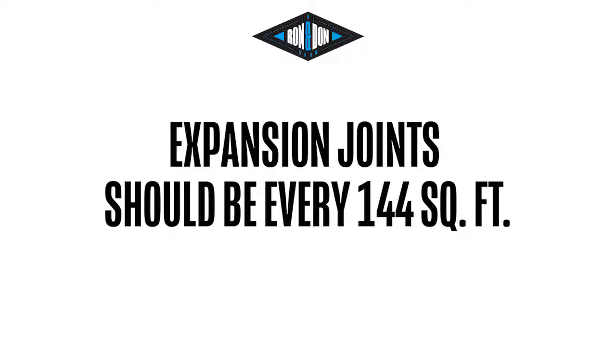If we're talking about a hard coat stucco system, and we're getting cracks, typically we have a couple of things going on. One, we could have a very thin base coat for the stucco, or two, we may not have enough expansion joints where they're required. So if we look at the requirements for expansion joints in stucco, it's every 144 square feet, at the top and bottom corner of windows and doors, or my favorite one, which is actually written into the code, where you think the system may crack.